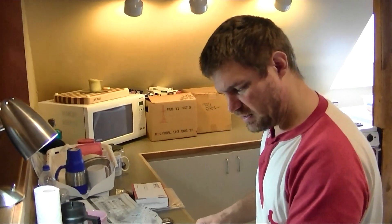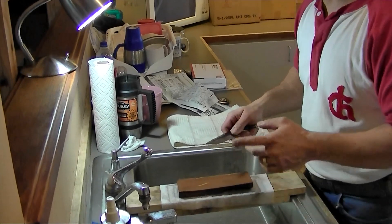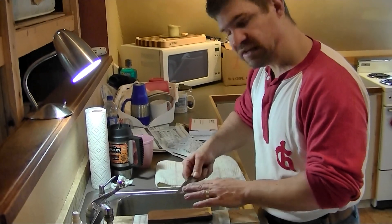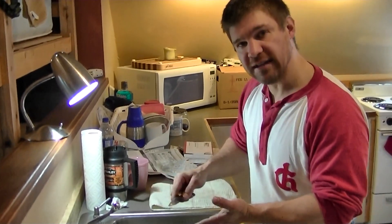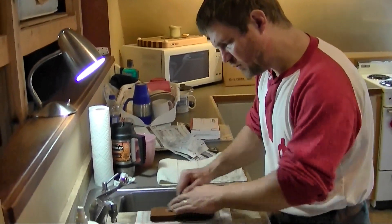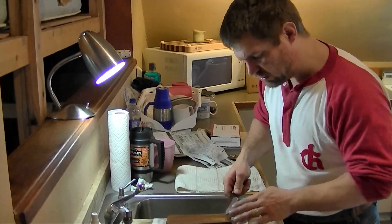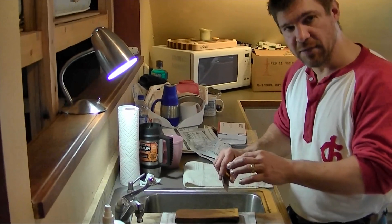Myself personally, because I sharpen all of my knives by hand, all my edges are convex by default. The reason is that when I'm sharpening freehand, there's always going to be some indiscriminate rocking in this wrist and in this hand and in the blade as I'm sharpening. So in reality, every stroke I take on the stone, I'm getting different facets of grinding occurring on the edge. That occurs with both sides when you freehand. There's no way you can humanly follow two strokes on a stone and get them exactly at the same angle each time. So by default, my edges become slightly convex.